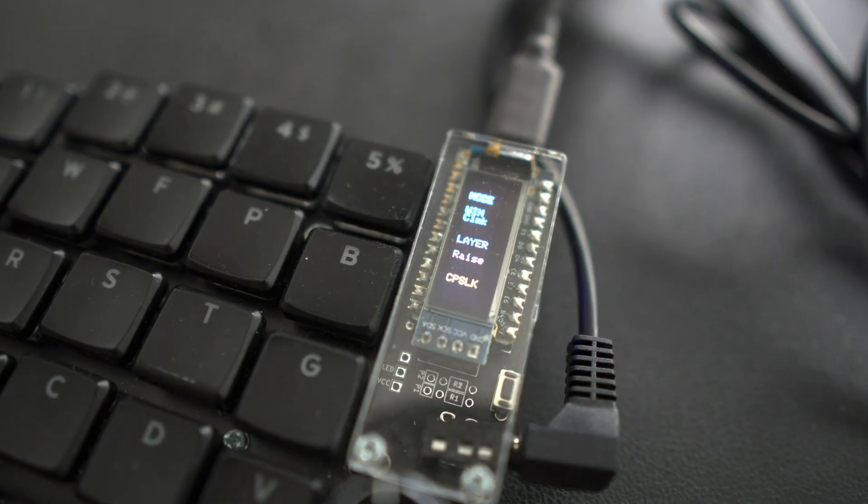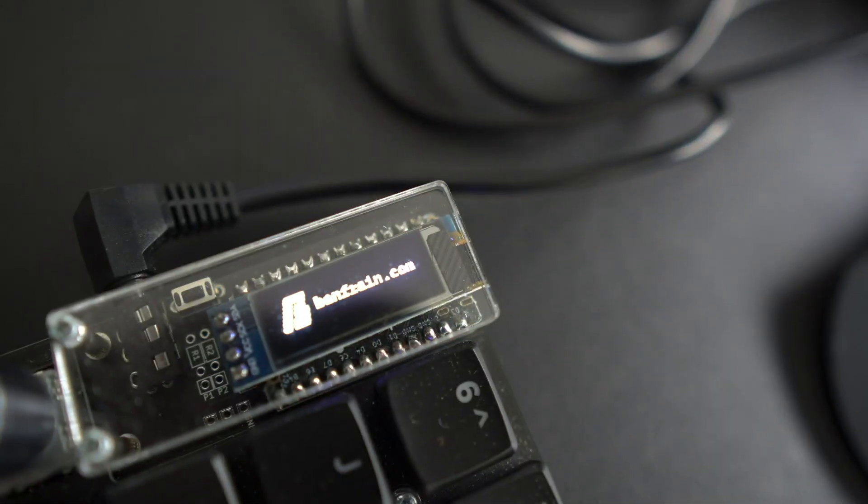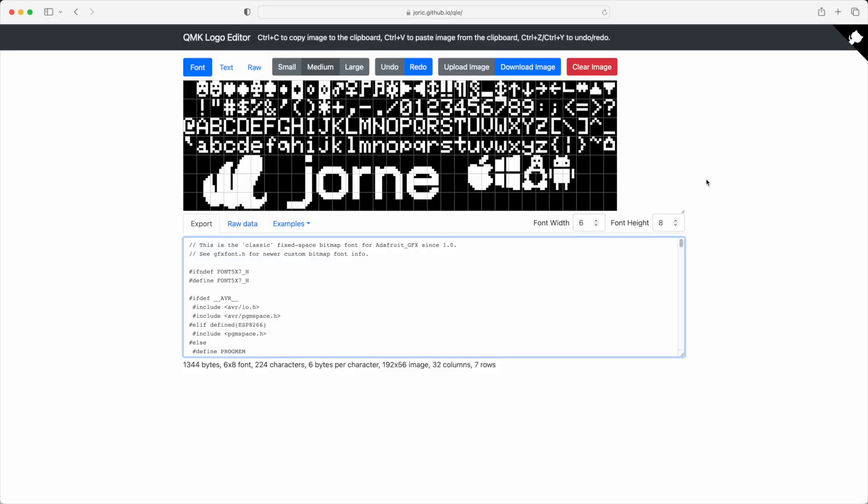One pretty cool thing is that with the OLED displays you can configure them to do whatever you want. I'm not a big fan of layers so mine just toggles between two layers on the left-hand side showing me that, and on the right-hand side I managed to make a logo of my site onto one of the screens. I'll put some links below — there are a couple of online resources where you can upload a graphic and get the equivalent ASCII art to paste in to get that logo appearing on your OLED. To summarise: you make your key mapping, put your OLED graphics in the code if you want, flash it via QMK, and then you're away.